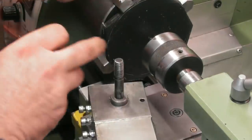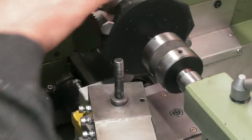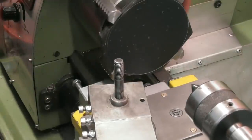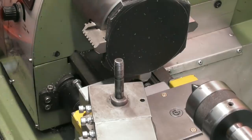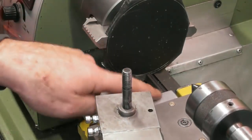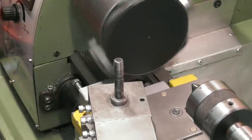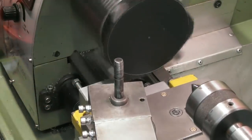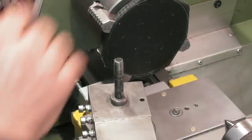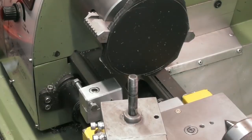I'm just going round the four jaws now, tightening up on the plastic. I can't go mad on the tightening here because it is just a piece of plastic and it's not very thick. I've got very little clearance — in fact none — between my carriage stop and the outside edge of the jaws. So just to do a bit of idiot prevention for myself, I've set my carriage stop so I can come as far as there and I'm not going to go crashing into any objects — because the jaws are stuck out quite a way.